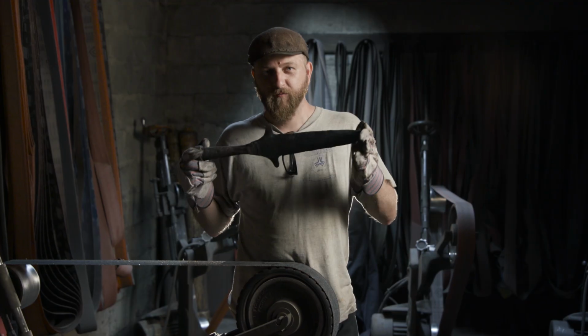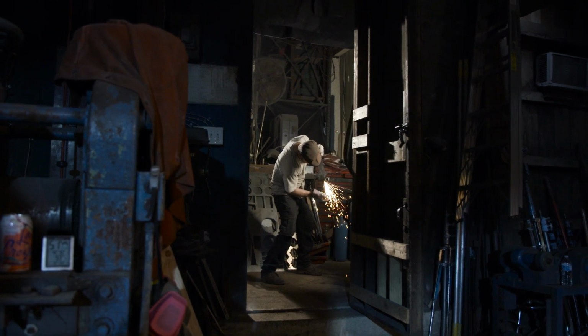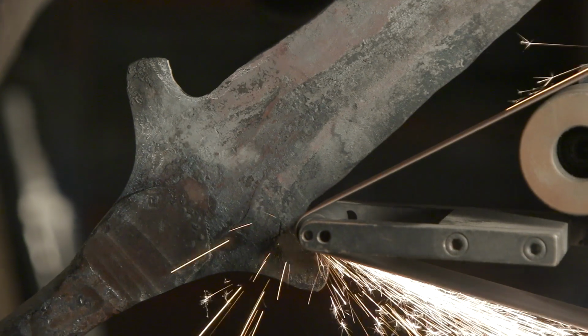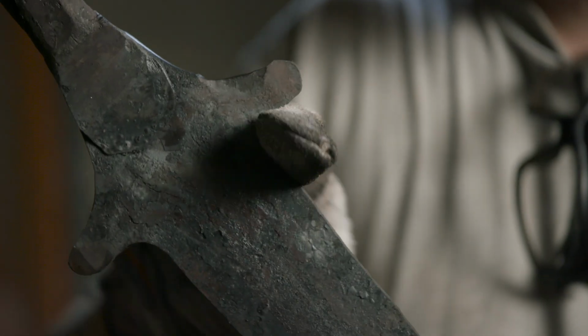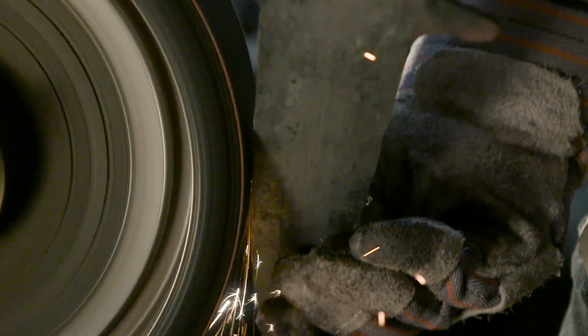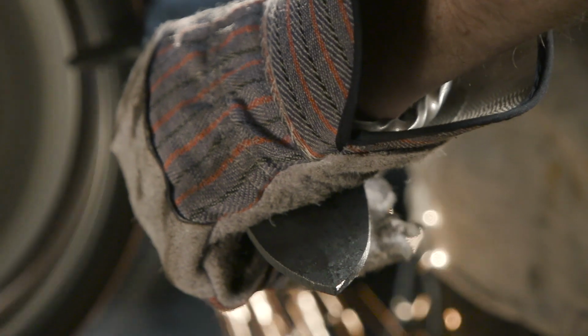With the spear now forged to shape, the socket attached, I've already moved on to doing some grinding. I used a 2-inch wheel to scoop away material back here and a little 1/2-inch wheel to get right underneath our hooks. Now it's time to move on to doing the perimeter and the actual edge grinding on our spear. I'm also going to clean up the socket, get that material as clean as possible before heat treat.